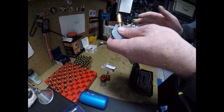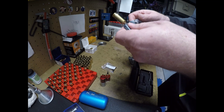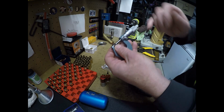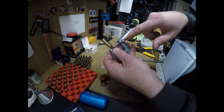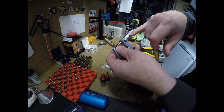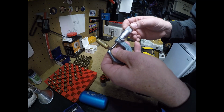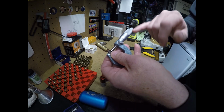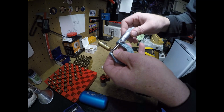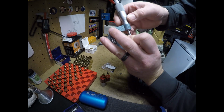Generally people try to have that clearance anywhere from 2/1000 to 7/1000 of an inch. So in order to figure out how much clearance I have, this is the kind of tool that would help. We look here, this is our first digit. We're on the 2, we haven't gotten to the 3, so basically we have 0.2. Oh wait, I'm sorry, that's a quarter hash and a half a hash, so 2.5. So we're at 0.25. We have not got to 10, which would mean 0.26, so we're at about 0.259, and then we look here, where 0 lines up perfectly.